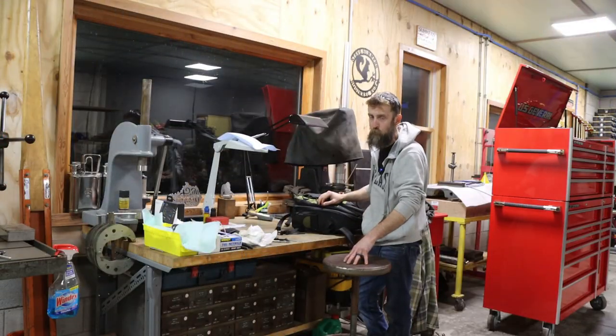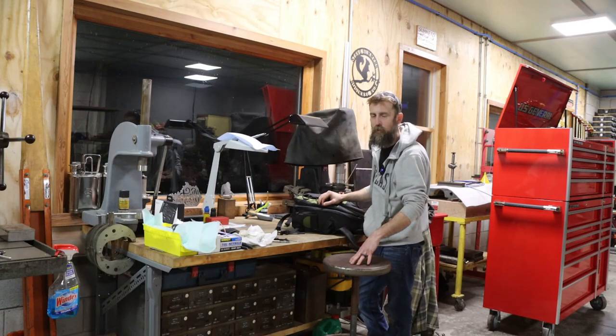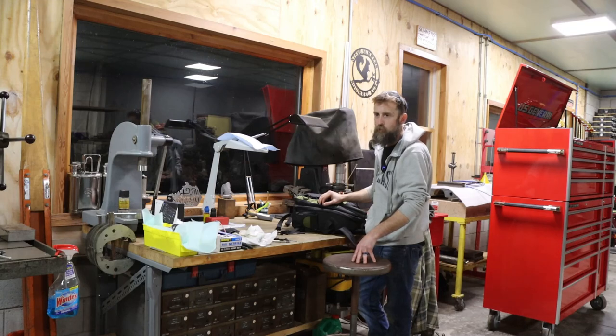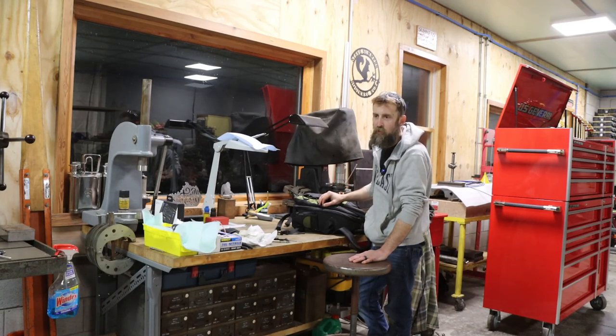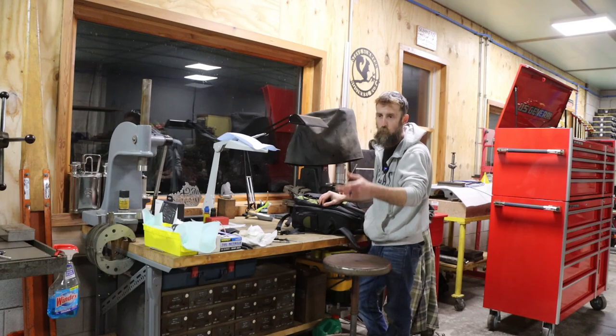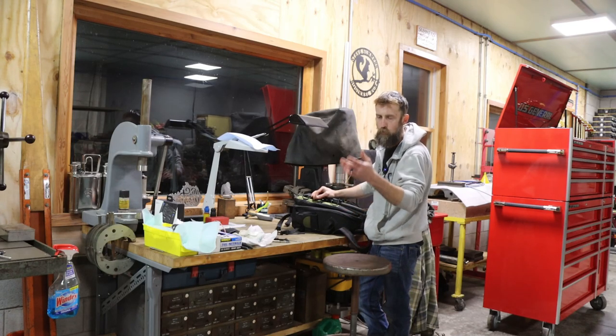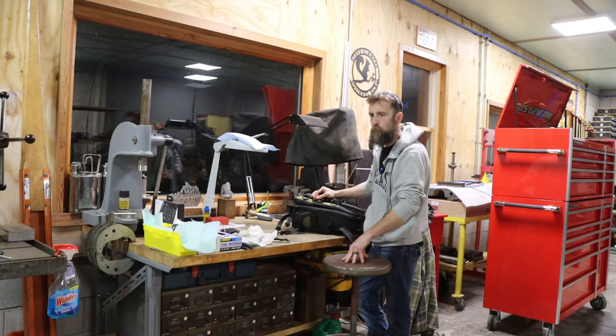So those crankshafts are pretty good material, and they're made to bend and not break. You can imagine, they do on occasion break off, but these lawnmower manufacturers don't want the crankshafts breaking off with the blade whirling around, so they're good steel. You probably could get away, especially with that one not being bent that bad, probably a couple hundred thousandths out, maybe a little more, by tweaking it back to true. And maybe in the future we'll do it. For personal use, that's okay. But it's not something I would do and then sell.